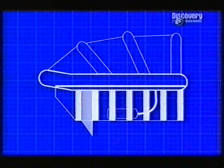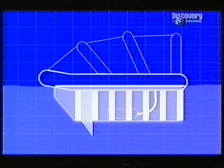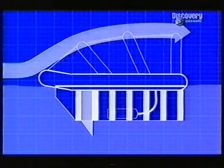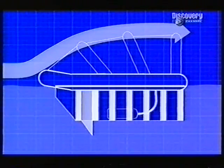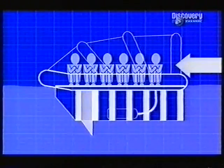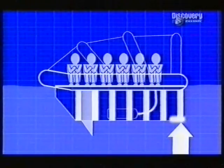Peter's raft is clever because of the multifunctional nature of its components. The container that holds it folds open to become the hull of the raft. Pockets inside the hull are designed to fill with water upon inflation and act as ballast, keeping the raft upright and stable. The canopy is aerodynamically shaped so that the raft swings into wind because of the resistance in the water, creating an area that's shielded from the rough weather, and has a step for improved access.